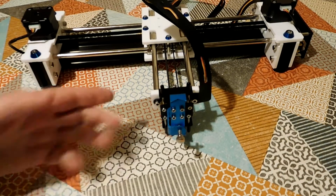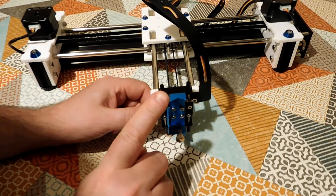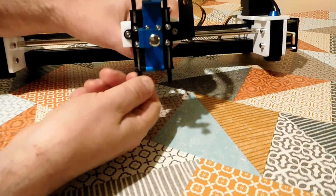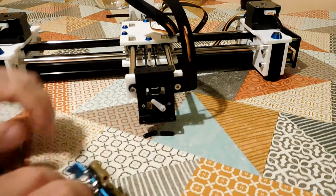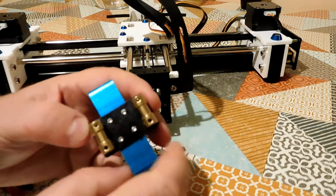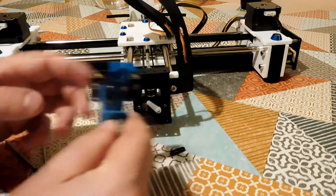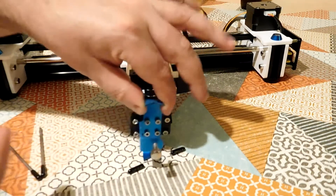The pen lifting mechanism — I'm not sure if I've assembled this right because I was talking to somebody else who has theirs set up so the servo pushes the pen down and they've had to fit a spring to return it to the upright position. I've actually turned my servo so the spindle is on the right-hand side, with the servo horn there, and moved the screw so it sits on top of the servo horn. When the pen servo turns, the pen mechanism drops, and all I need is a bit of weight on the pen to press it against the paper. The servo either lifts it off the paper or gravity pushes it back down.